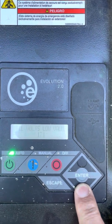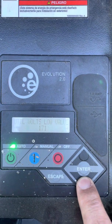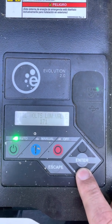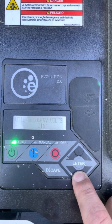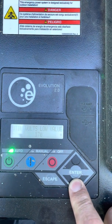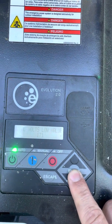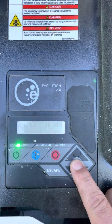We don't want to change run hours. Under 'utility volts low value' — this is the value at which your generator will turn on. Once the voltage gets below 171, that's when the generator will turn on. You have to hit enter to adjust it, and it only goes up to 171. It was set from the factory at 140, which is far too low. I think even 171 is too low considering you're supposed to be at 240, but that's the maximum you can set it at.